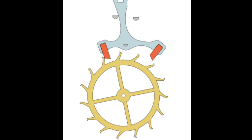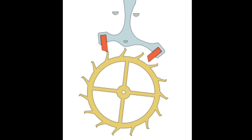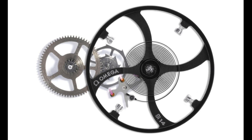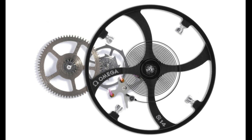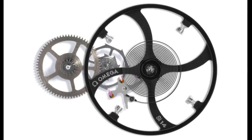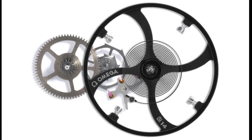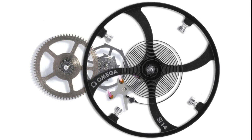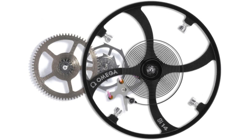The escapement is effectively a two-tined fork which engages and disengages the escape wheel, and by stopping and starting this wheel you get those ticks per second seen in the second hand of a watch. I certainly can't overestimate how brilliant this piece of engineering is, because it's lasted so many years since the 17th century — but that means it remains a piece of 17th century technology. Though movements are no longer susceptible to magnetism through new lubricants and antimagnetic parts such as silicon springs, we still have the problem that temperature does have a minor effect.